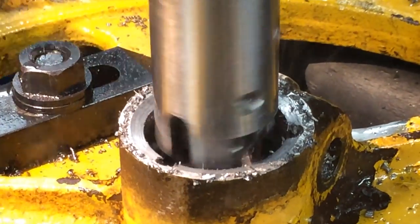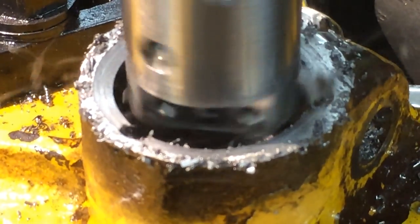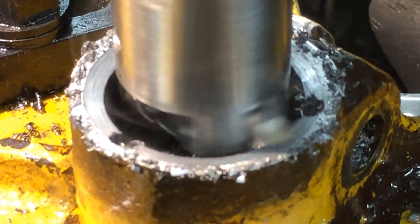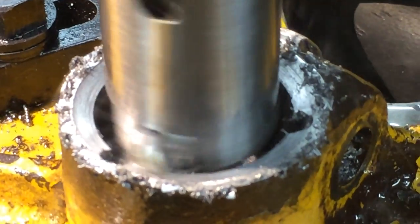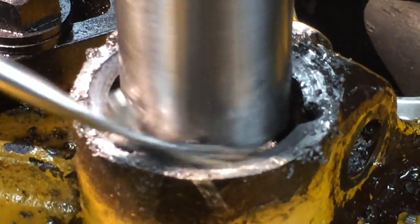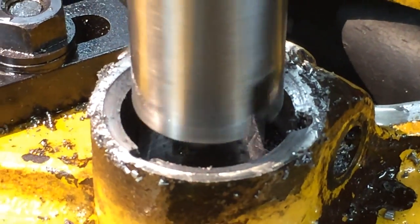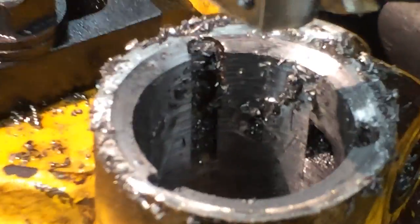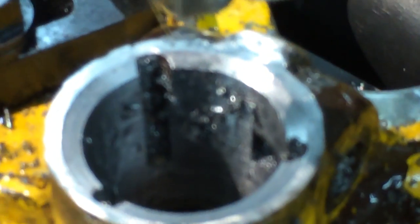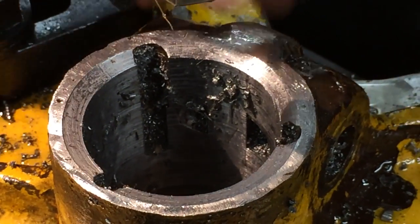Rigid tool, man. Thank you. Yeah, this is the first time that it's been used ever. So I'm happy with it. But what I'm going to do is come out so that I'm half the distance between the bore. I think we're there. Okay, I'm going to let it dwell for a minute. Taking our spring cut right now. As you can hear, a little bit of chatter, we're backing out. And I'll get your close-up shot here in a second. All right, man, another step closer. It's got some chatter, but...